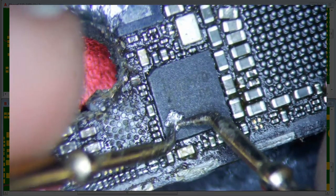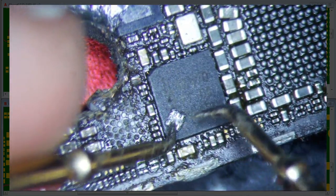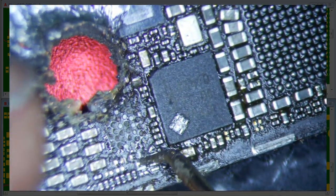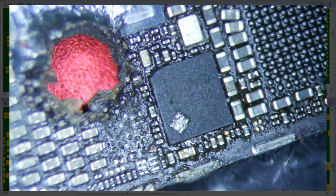This is 0.50 as well. Interesting — 0.504 and 0.50. So this is about the same as Mason. Now I'm getting 0.446 — so this looks like it goes directly to the CPU. But it still doesn't explain why we're getting 0.454. I'm still at a loss here.